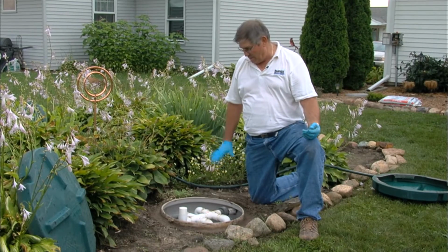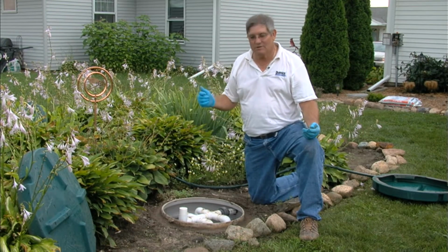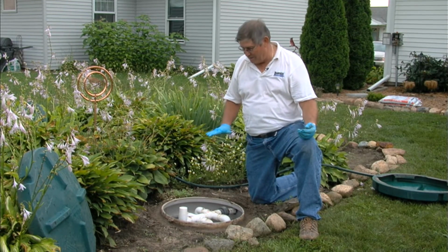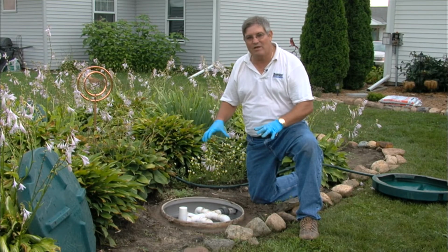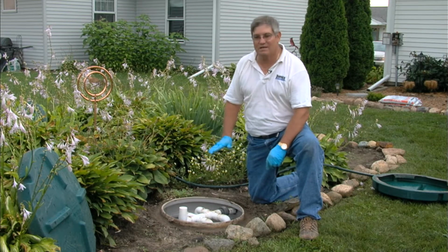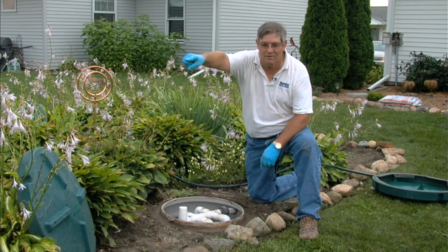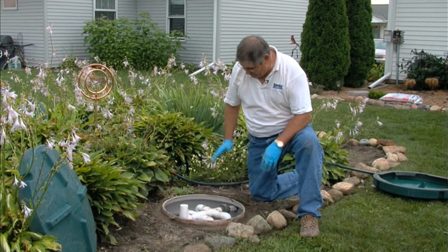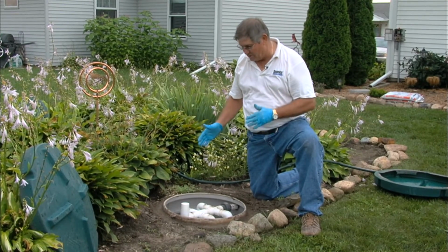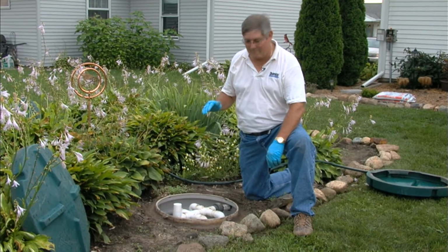The last apparatus that you need to be concerned about would be the recirculation device, or the splitter. The purpose of the splitter is to split the flow after it's been treated in the treatment module, 80-20 or 4-to-1. 80% of this flow will actually be collected and sent back to the headworks of the septic tank. 20% then is discharged to the direct discharge line. There's not a whole lot that you can do as far as routine maintenance is concerned on this. The main thing is that when it's installed, you need to make sure that it's level as possible.